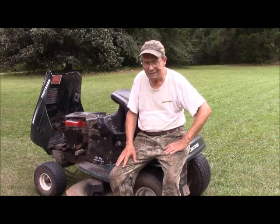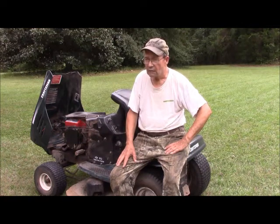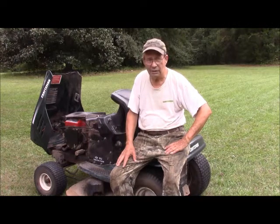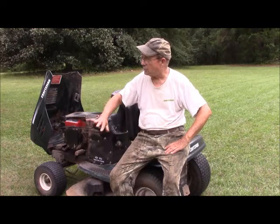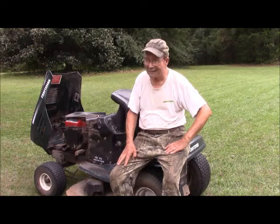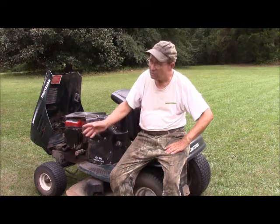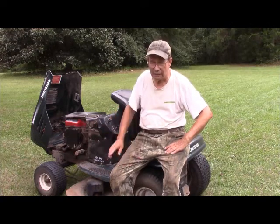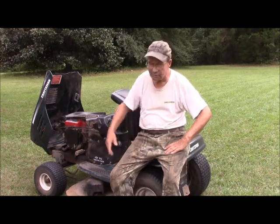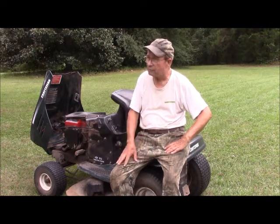The steering is still loose for reasons I've yet to identify. For worn out blades, it cut pretty well, actually. There are a few ridges left because of the irregularities of the blades the way they are right now. Yeah, they need changing. But the setup for changing the blades is pretty much standard with any other decked lawnmower like this. You pull 4 pins and that drops the deck, and you push the deck back and disconnect the drive belts, and the drive belts look okay.